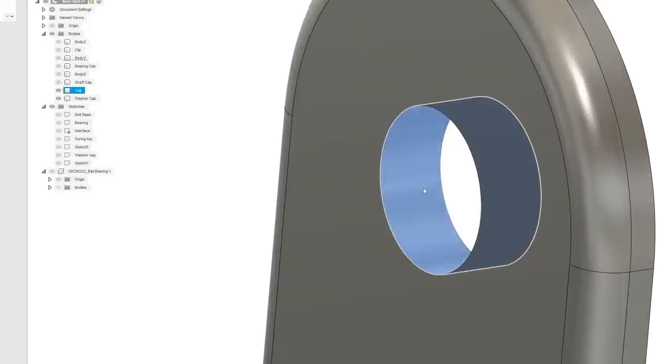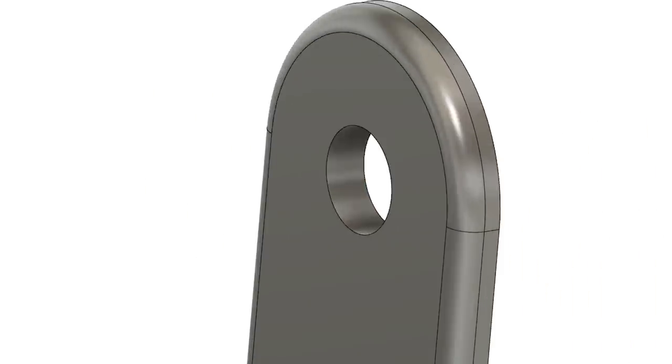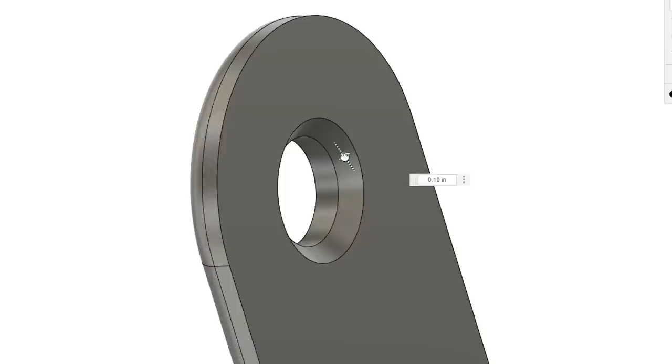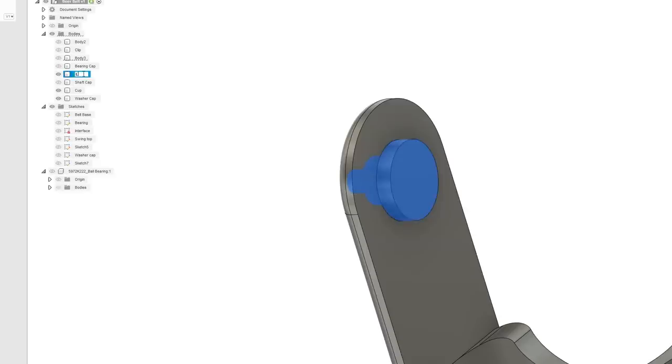Although I'm going to press and pull this just a little bit, just so we have enough tolerance. And also, assuming I stick it through on this side, I'm going to put a little bit of a chamfer to help the part go through. I don't think I need that much of a chamfer. So I'll call this the linkage. That part will go through there.